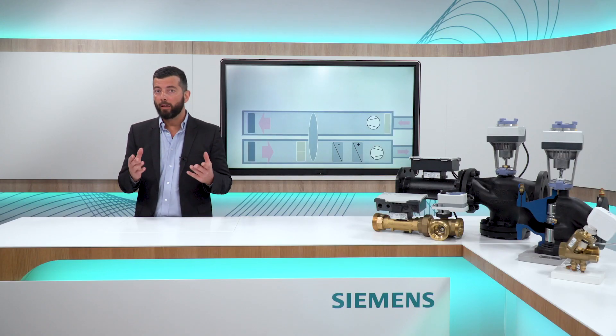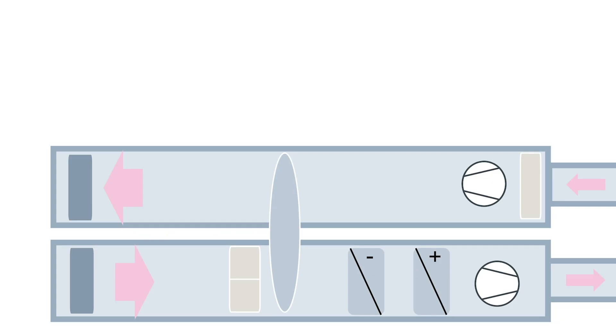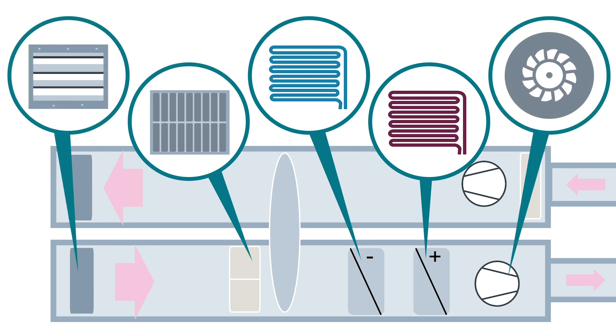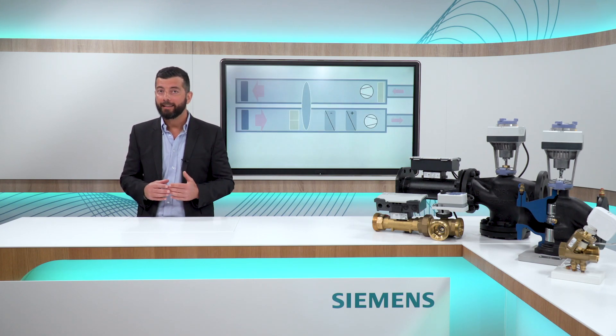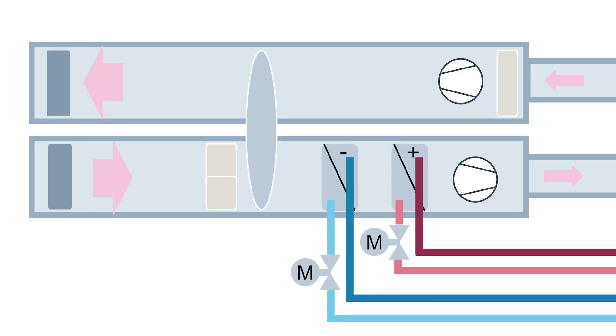That air will create the comfort for the people in the building. In this episode, we are not looking to discuss all possible variants of AHUs, but we will consider a simple AHU for more clarity and better focus on the hydronic aspects of it. If you look at the inlet section, you can spot the heating and cooling coils between the air filter and the fan. The two coils are fundamental for making sure the air is properly treated, and it is important that the hydronic system always delivers the required heating and cooling capacity. Therefore, dynamic hydronic balancing becomes very important again.